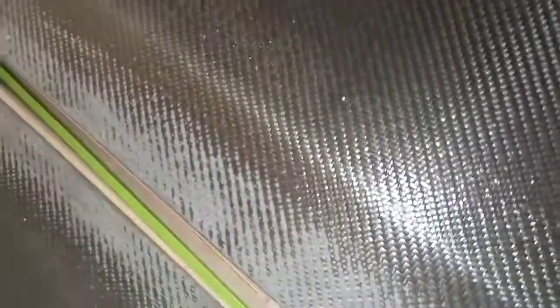I want to push it tight against the hull so it doesn't narrow the slot too much for the centerboard. I've made up this little piece of quarter-inch plywood, and I'm going to put it in here along with wedges that push down on a small piece I've hot-glue-gunned to the middle. That'll push out against the edge, giving it a better bond and making sure the gap doesn't close up too much. Once I'm done on this side, I'll rotate it over and do the same thing on the other side.